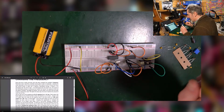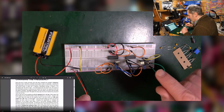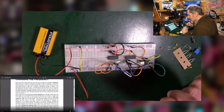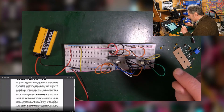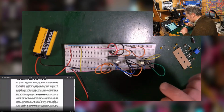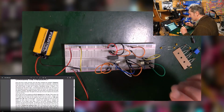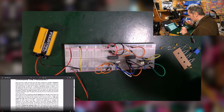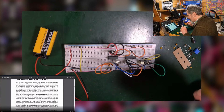Oh, I'm really on it now. So if it's discharging fast, the pitch is high. If it's discharging slow, the pitch is low. Speed of the discharge process is determined by exactly 2 factors: capacitor size and resistor strength. The bigger the balloon, the more water it can store, the longer it takes. The tighter the drain, the more it restricts the amount that can flow. Right. Let's try this out by swapping the 2.2 nanofarad capacitor for a larger one.